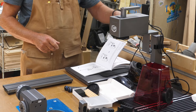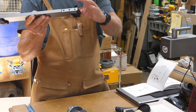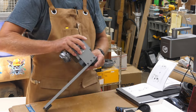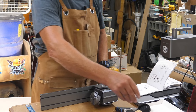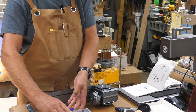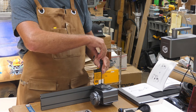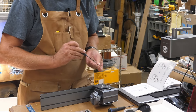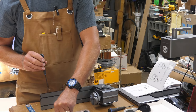The base plate here has six holes on one end — three on each side — and the rotary itself will mount to that. We're going to need some screws for that: M5 by 10s from your little toolkit. You'll need a 3mm Allen driver for those.